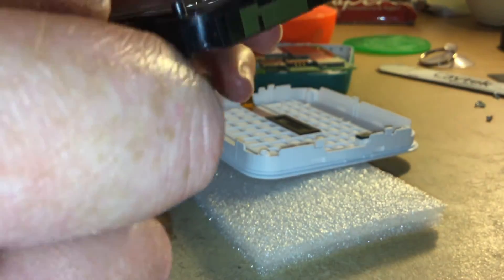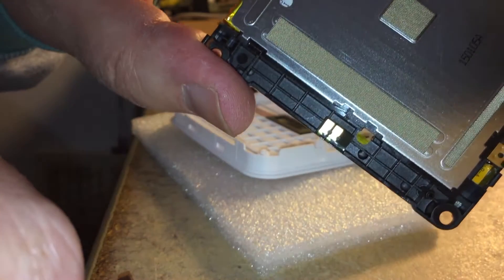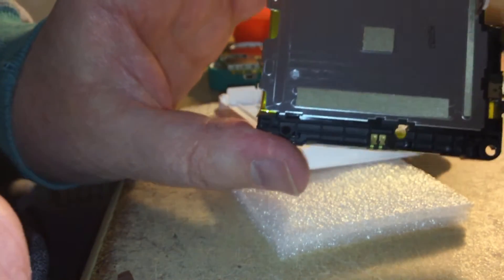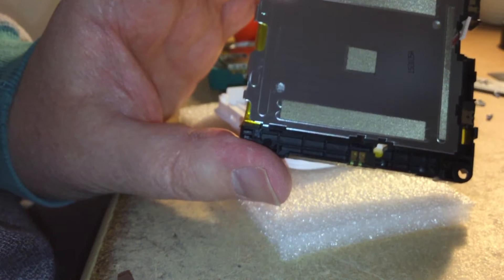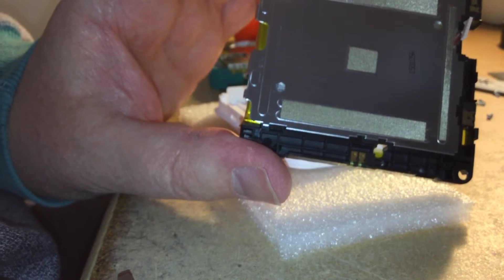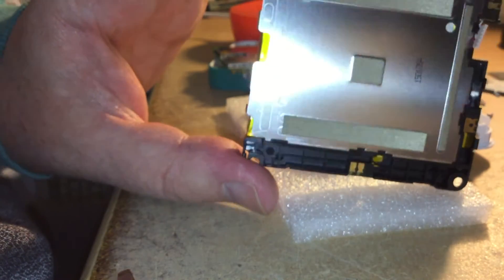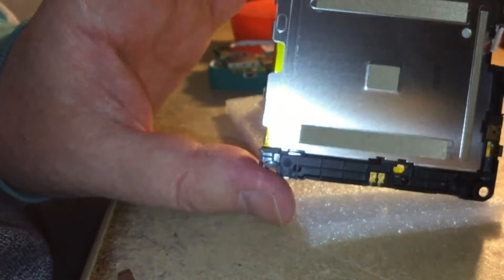Running inside this device is a little — I think it's an Android server actually, some sort of Android OS. You can connect to it by SSH: connect to it via Wi-Fi then SSH into it, obviously on port 22. The username is root, the password is OELinux123 — that's Oscar Echo Linux, all one word. That's the password. The O is alphabetical O, not the numerical zero. I'll put the details underneath the video anyway.